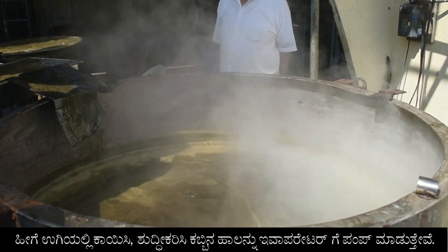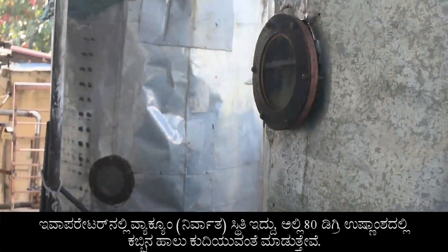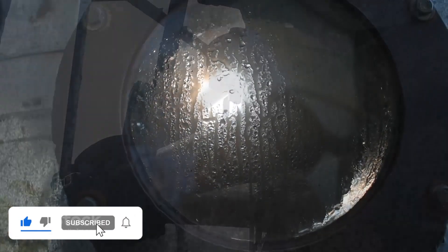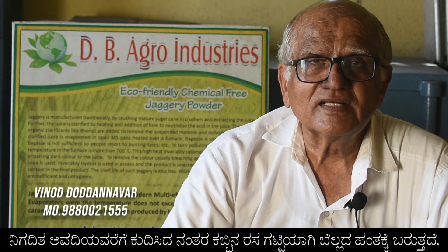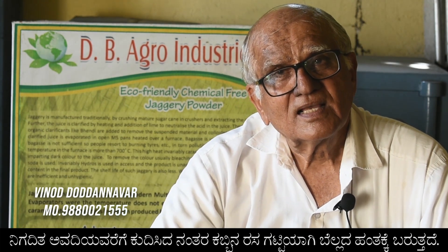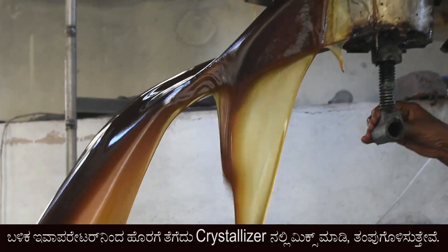When it boils at 103 degrees, the bindi extract extracts the non-sugars and gums, and the scum is removed by physical screening out the impurities. The clear juice is then pumped into evaporators for further processing. In the evaporator, we apply vacuum. Sugarcane juice boils in vacuum at about 80 degrees, all the water is removed, and at a certain stage the sugar juice is thickened. We continuously keep adding clear sugarcane juice into the evaporators, and as the product gets thickened to a certain stage of boiling — we call it the strike point — it is dropped and cooled.